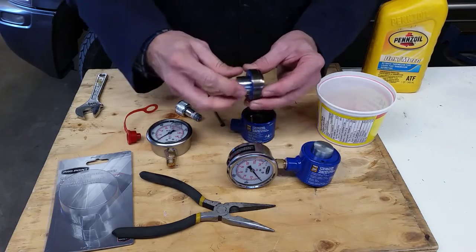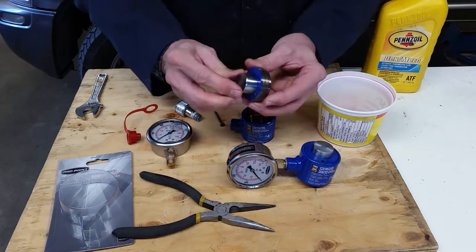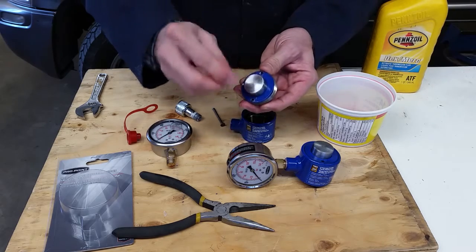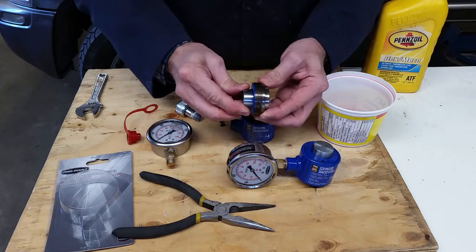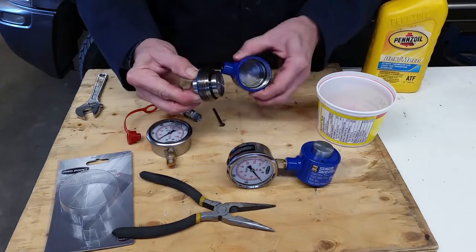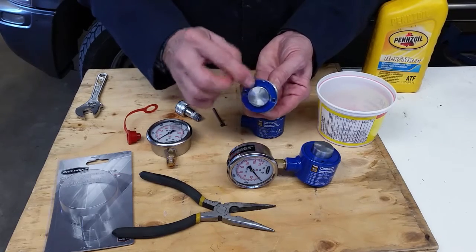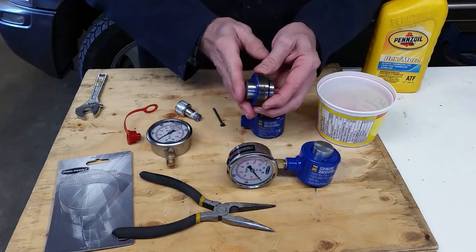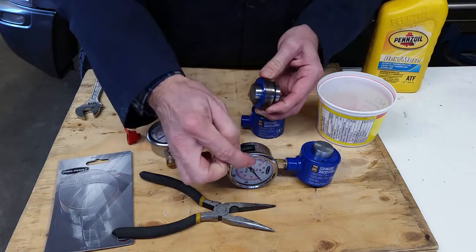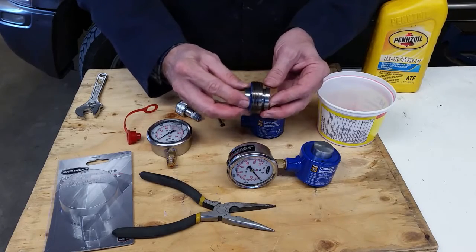What I found with this in use is that if you assemble it with the ram all the way out, it has a tendency to bind in the bore as it's being pressed down, so it's not really accurate at really low pressures. What I found was if you set it in about halfway, this piece sits deeper in the bore and it really helps to stabilize the piston. So I would recommend having it about halfway down. I found that even a weight pressing the piston in by about a quarter of an inch will actually bottom the gauge at 2,000 PSI. So this is the better way to work this particular ram.